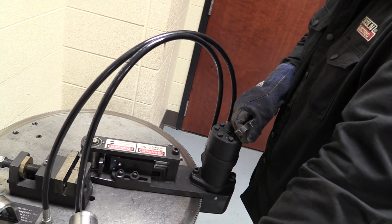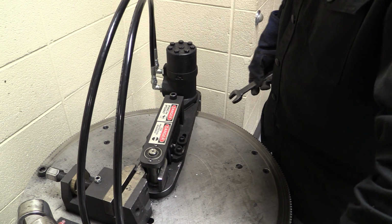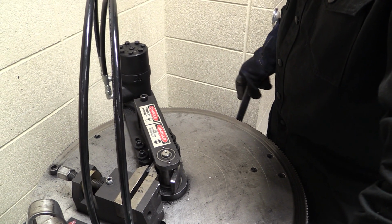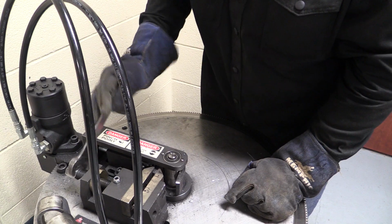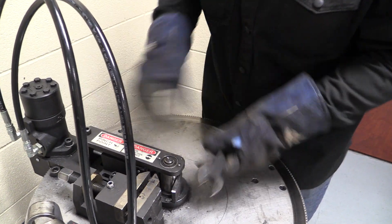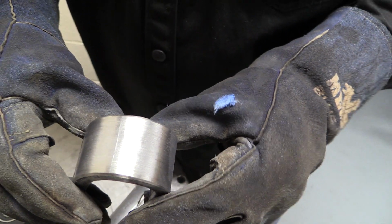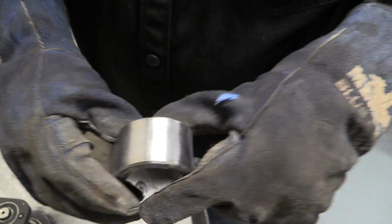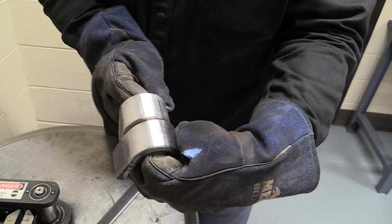Bring it back. And no, there's not a second gear. It's just the speed that it is. Relax. Take your time. We loosen up the clamp. We shut the machine off. And look at that. Even this one bent good. So there's the root pass of the weld. You can see the edges of it. So that's kind of surprising. Both of them passed well even after quenching this weld and moving pretty fast with it because of video purposes.